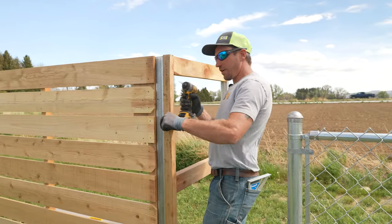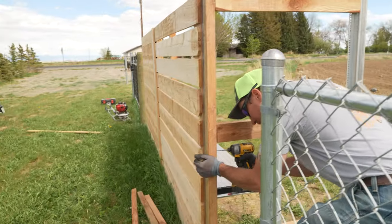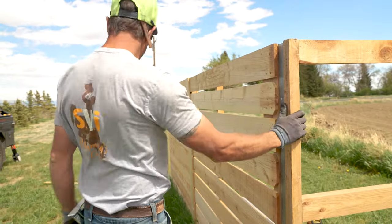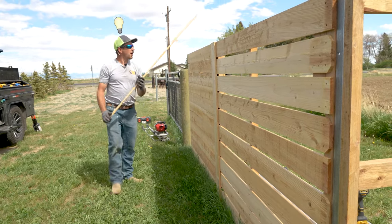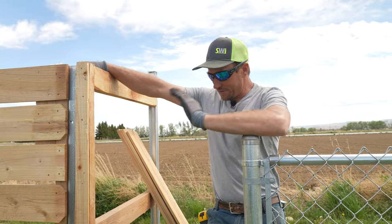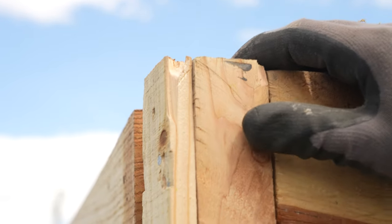So what we're going to do is put our nailer piece in — let's say three screws. This helps us with covering our outside corner. So we put our nailer strip in here, and what this does is bring us to the same plane as the horizontal cedar.